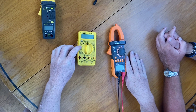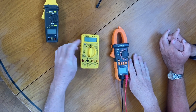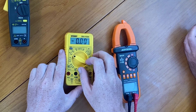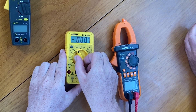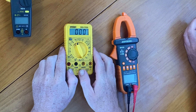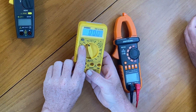The reason I brought two meters is because they can be different in how they're set up. This is an older one and you have various ranges for volts. This is for measuring up to two volts. If you're measuring up to 20 volts, you want to set it here. If you're measuring to 200 volts, you want to set it there, and up to a thousand. Now you'll notice there's two different volt sections — this is probably the most confusing thing to folks on a multimeter. You have a straight line with dashes — that is DC voltage, because it's direct current.